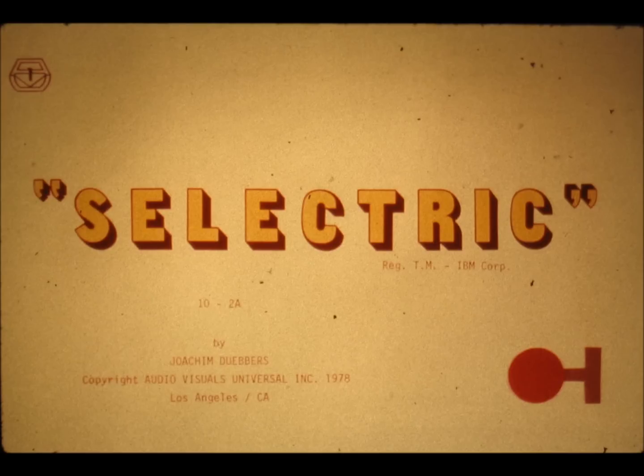Please use slide number one to focus your projector. Throughout our activities of servicing electromechanical equipment, we should keep in mind that whenever a mechanism is activated by torque delivered by a motor, it will also have springs in order to bring its parts back to their rest position. Conversely, whenever a mechanism is activated by the power stored in a spring, some alternate source of power — usually the motor — is needed in order to restore the spring tension used up in the process.